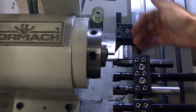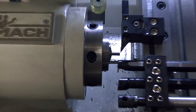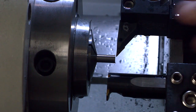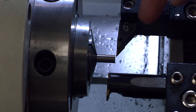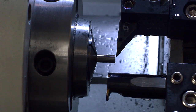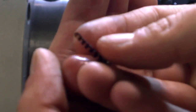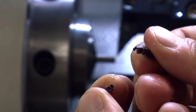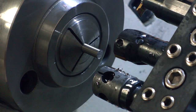I edited the code so it just does one part, but it'll still pull the bar out and do the whole cycle and stop at the end. One thing to pay attention to is the first cut with the tool down here — it's a pretty aggressive cut and makes a really wicked chip. The chip that comes off is blue and bronze, huge and thick, really cool. It is an aggressive cut and it's destroying the insert over time, but it's still making a good cut, so whatever — it's just a roughing tool.